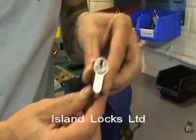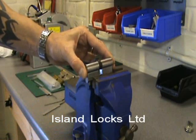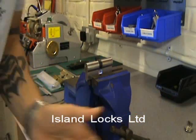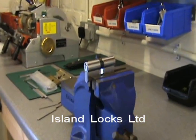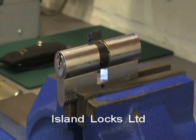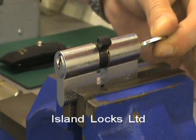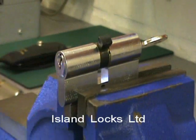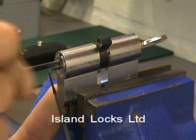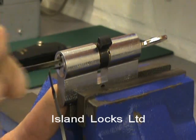So what I'm going to show you is an easier way we can do that on this lock where the cam is offset. Both sides are in their lock position. First thing is to pop this lock into a vise — take the lock out of the door and clamp it so you can see. I'm going to zoom in a bit more so you get a better look. We've got our lock there and you can see the cam's in the wrong position. Get the key or one of the keys for the lock, insert it into the keyway — don't keep it upright, give it a slight turn so that key can't come out. Next, we're going to pick the lock, just the same way as you would pick any pin tumbler lock.